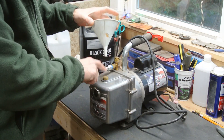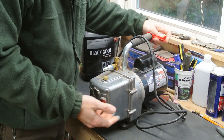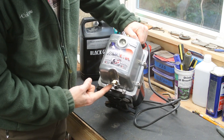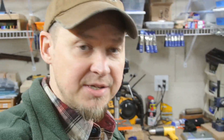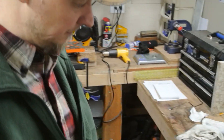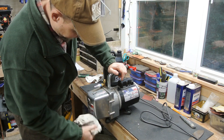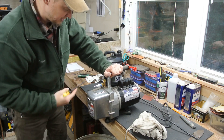You can look it up and see what you need for the viscosity and stuff like that. I need a little funnel because this is where your oil goes back in. On this pump — and I'd assume they're all going to be about the same — there's going to be a drain at the bottom, and right here is where the drain plug is. I'll go ahead and close that valve up in a second and then flip the pump around, because we have to remove this housing back here. I grabbed the garbage can and set it in here so if anything's dripping it would fall inside.